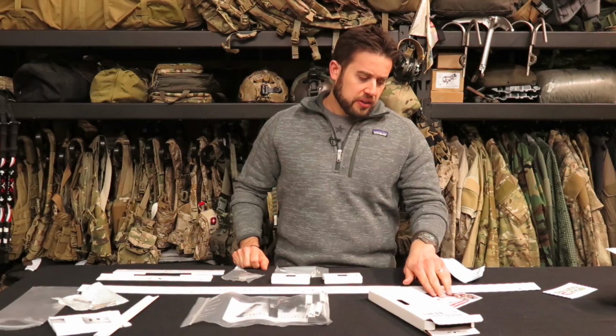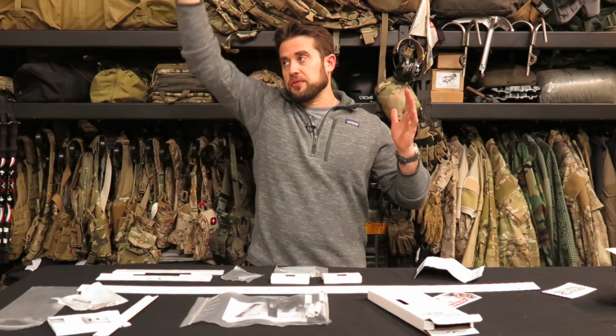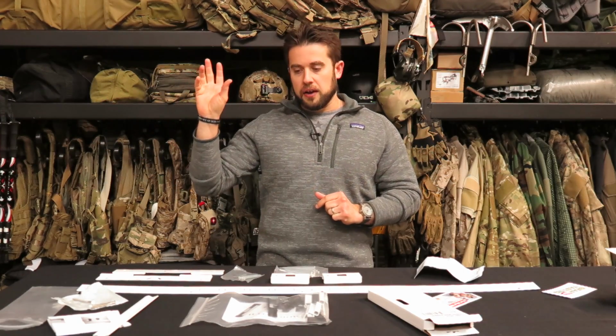And they also offer security for side light doors, and if you don't know what I'm talking about, that's a front door that has a little pane of glass or something right here. I can talk forever on home security, so apologize. Those things are notorious for people just breaking out that little piece of window and coming around and opening your door, which is super easy to do if you have a deadbolt on the inside that can just be opened. That's why I advocate having a double cylinder lock, so that the lock on the back side is also lockable, so that if someone was to break through that little piece of glass, they couldn't just reach in, flip a thumb turn and then get into your house.